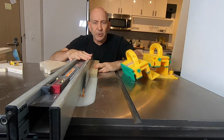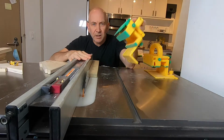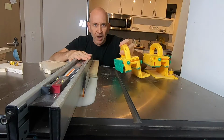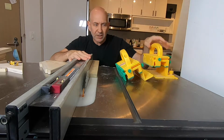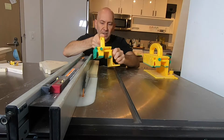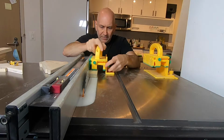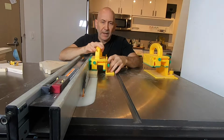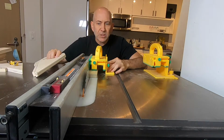And then, of course, if you're going to use a fence for a rip cut, then the number one tool you want to use is a push block. And the gripper push blocks from Microjig, I think, are by far the best. I recommend getting the full Monty set, and they're very adjustable, so it's easy to set up for a difficult, say a narrow cut like that, just like this. And you can put a tailpiece on the back, and this is really the right tool for the job. You don't want to mess around with push sticks for most difficult cuts.